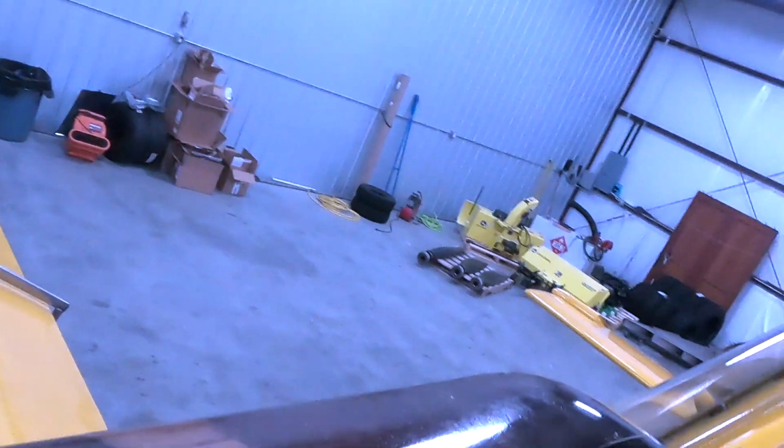So there's 2 bolts on each side of the split. I've got the front bolts out. So theoretically, that should slide out of there. Now, I've got 2 of those bolts out already. I'm gonna take the other 2 out, just because I only wanna have to handle half the frame instead of half the frame and the auger, since I'm doing this by myself. And then there will be 4 bolts up above to get that frame out, but we'll get these other 2 out of the bearing block first.